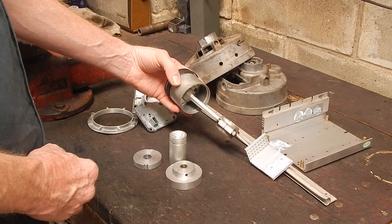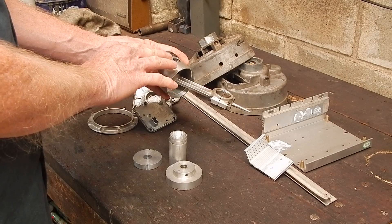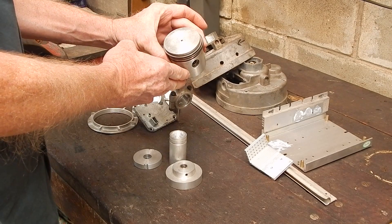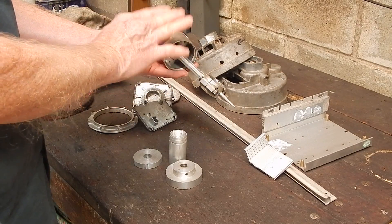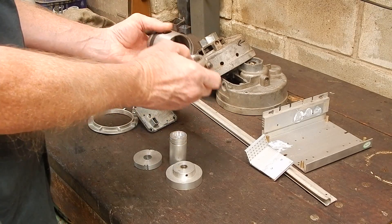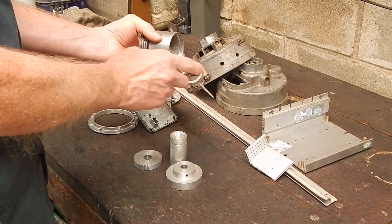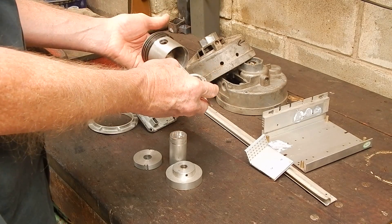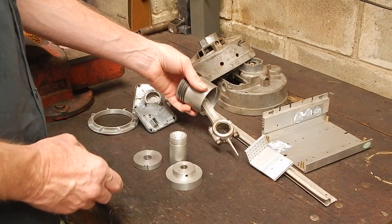Pistons out of engines — excellent, this is really hard stuff, very good quality, better quality than that for sure. Pistons in motors get a real pounding and they have to deal with extreme pressure, heat and everything. So piston aluminium is great — probably one of the better things you can use. Even the conrod on this motor is aluminium. Quite often they're steel, but this one's got an aluminium conrod as well. That would be good aluminium to use because there's a lot of force put onto an engine conrod and it has to have good rigidity.